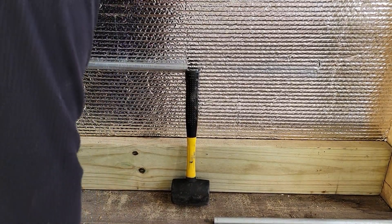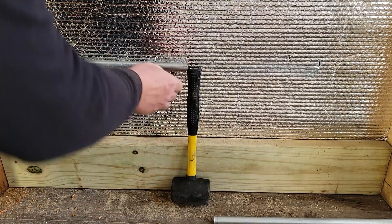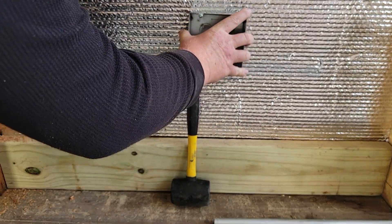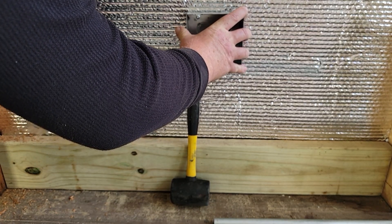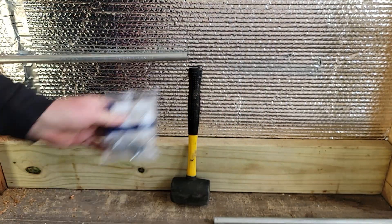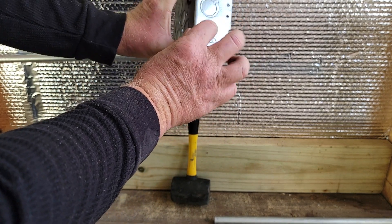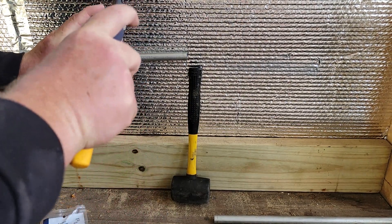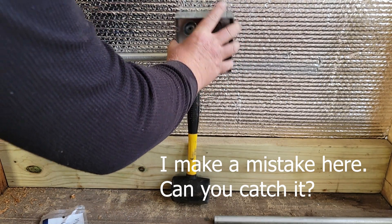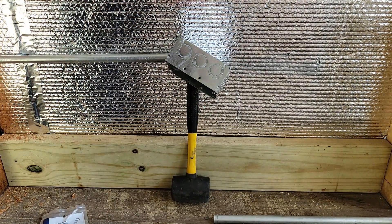Continuing with my NASA certified height adjustment — all I use is a hammer to figure out how high I want these boxes. I was going to use a half-inch offset EMT box offset, but I don't need to do that. I'm going to knock that one right out of the box. There's two rings — you've got to make sure you get the right ring, the little inner ring. Then I'll run some screws in there, go outside and caulk it. That's my project.